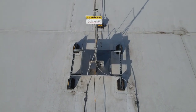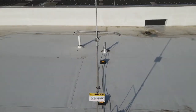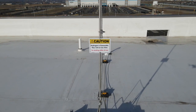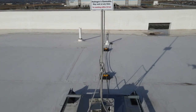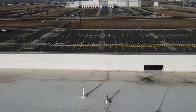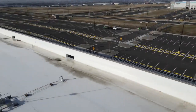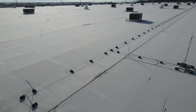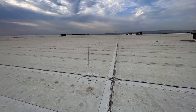Here's a hydrogen vent with a dead end of conductor 8 feet long. Then we branch off at the bottom with two paths to ground, air terminal mounted on the top. Here you can see some of the lightning rods on tripod braces we got right there. And notice the abrasion strip. That's required for the roof warranty. Conductor fastened every 3 feet.